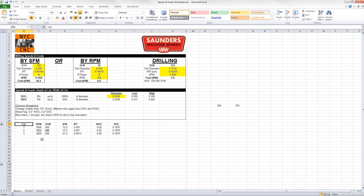We absolutely have to start with a recipe that works. I don't want to start with a recipe that's too aggressive where you get chatter and have to start downgrading the specs to find the sweet spot — let's find something that works and build up. I'm going to start actually below the lowest recommended surface footage per minute, and that's okay. Because frankly, I could create a good cut probably even at 50 surface feet per minute, which would only be 760 RPM. What matters more is the relationship between your inch per tooth, your cut, and the surface footage.